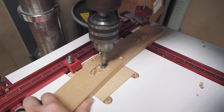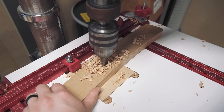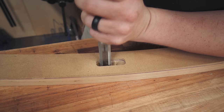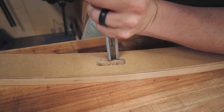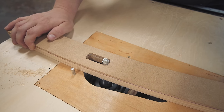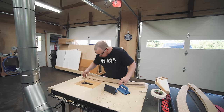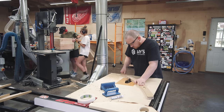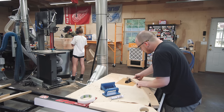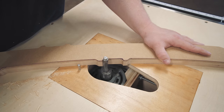The seat support legs will have one slat that is captured in a slot, and the slot is sized for a maximum thickness slat of three-quarters of an inch. I used a three-quarters inch Forstner bit to remove the bulk of the waste, followed by a few quick cleanup chops with a chisel, and then more template work back at the router table to get the slot perfect. The chisels reduced the chances of the bit grabbing on one of those ridges between the holes. With one set done, the templates are popped off and applied to the second set. I wanted to see if using the larger flush trim bit would speed things up — and I think it did, though there is the trade-off of having to change router bits. The larger bit makes quick work of the majority of the template, then it was back to the smaller bit for the tighter radius areas.